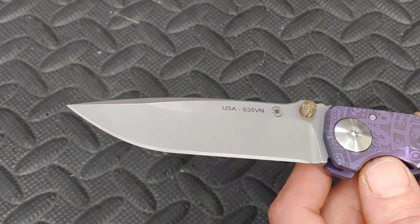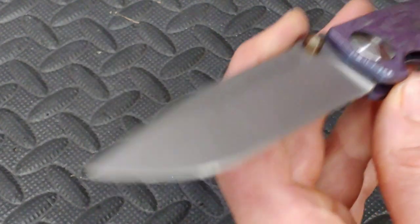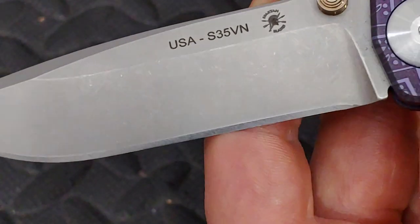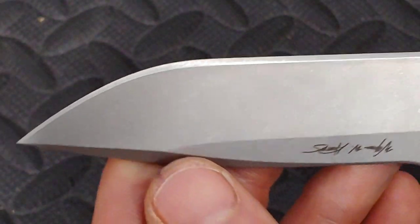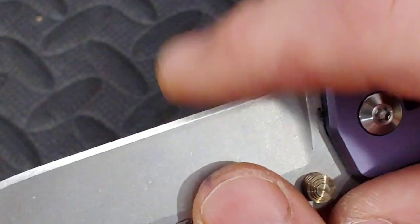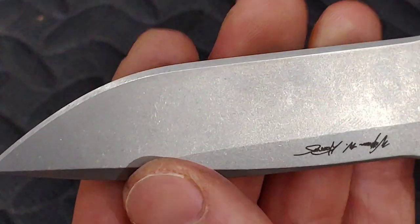And that's reprofiling, probably maybe a little bit longer to reprofile, but I did lay the edge back, so it's going to take a little bit longer. We'll look at the grit pattern, but I just wanted to show that it did sharpen up just fine. I just basically started right where they started, and I dragged it from there. Do you know what I mean? I just started right there on the stone and just started moving it, but this eventually will wind up going higher and higher and this will be left there. That's why eventually I will have to cut in a choil.